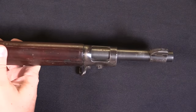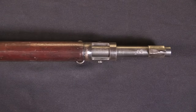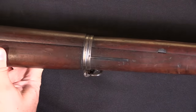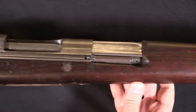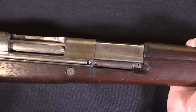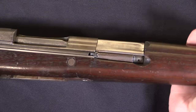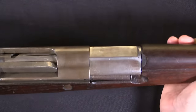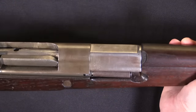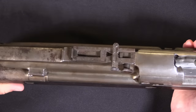Taking a quick look down the length of this thing before we start tearing it apart: we have a Springfield Armory 1914 barrel — specifically a February of 1914 barrel. The stock has been cut to fit Springfield bands and hardware, but it's not actually a 1903 Springfield stock, because the receiver is far longer than a Springfield and there's no splice in this stock. Someone custom made this stock and did a pretty nice job of it, making the front end look just like a Springfield. Only a few parts actually came from the donor Springfield: the barrel bands and nose cap, the barrel itself is the most important one, and also the rear sight.